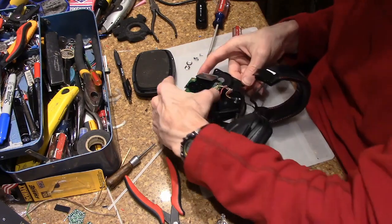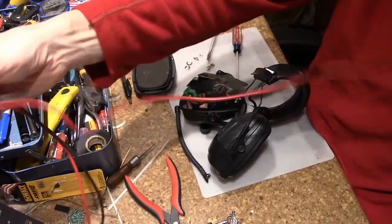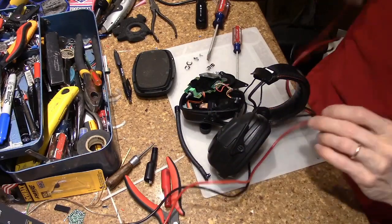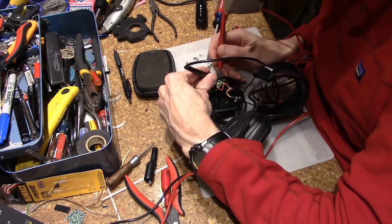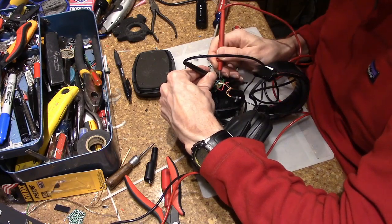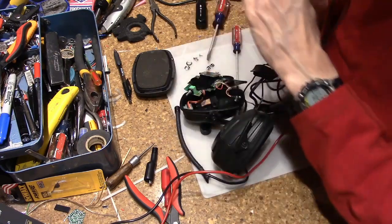Okay, so the first really obvious thing we're going to do is turn on our multimeter and see if we actually have power coming across from the battery. I'm going to be very disappointed if I disassembled this whole side and I should have just done the battery side on the other. And yes, I did put new batteries in. And the winner is, across battery and ground, the winner is 0 volts. Well, it could be a good thing. It could be a very annoying thing as well.